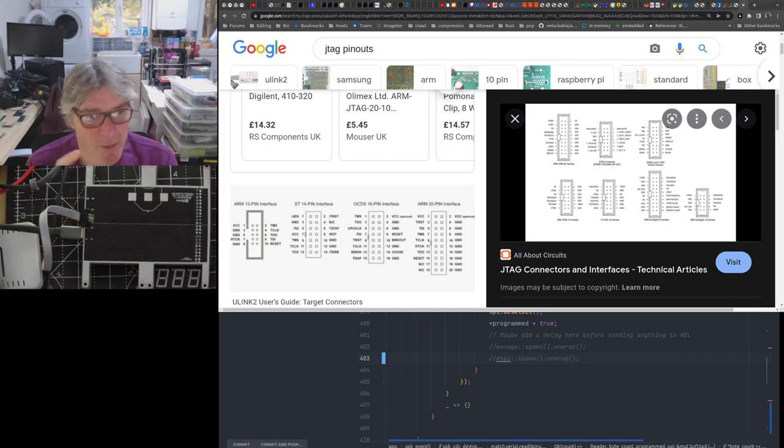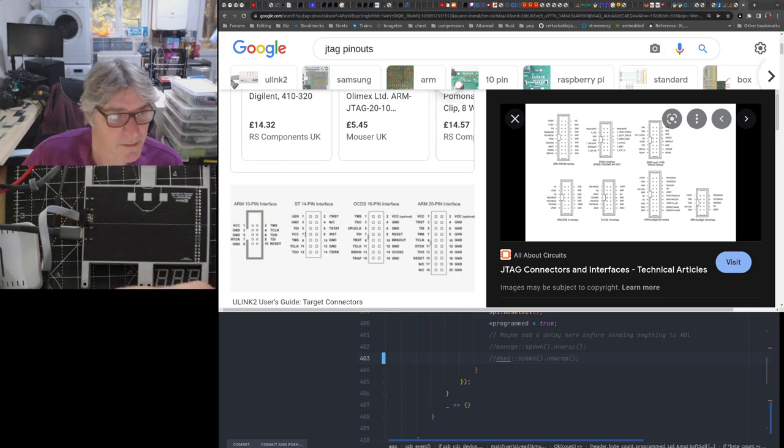But anyhow, that enabled me to run Blinky. I know it's a big step from there to it meant that I could program it with the changed code, fix the issues with the code, with the pin changes, carrying on from where we left off on that to-do list for the Black Crab firmware, the Rust firmware. And that did it. I was then also treated to the bonus that I could actually not only load firmware on it, but after some more pin adjustments, I could then use what's called the soft SPI, the BitBang driver with the pins. It does give me another problem, which I will talk about, along with some of the other things.